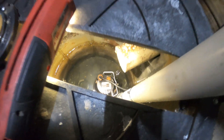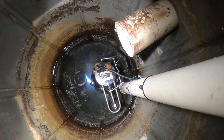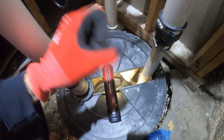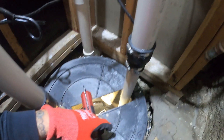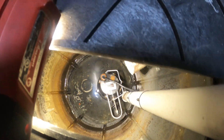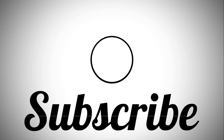Everything's closed up. I filled it up — let's plug it in, peace of mind, last time. Let's hear it turn on and off. Pump the water out and it's off. So that was it — those little three holes. I've seen it time and time again that it gets in the way of the float, and the float was right on the third leg. So we put the flat platform, put everything back together, checked for leaks, tested the pump, and that's about it. This should solve the issue. If anybody found this video interesting or helpful, please drop a like, comment, and subscribe. I'll catch you all next time.